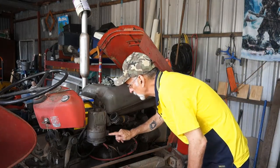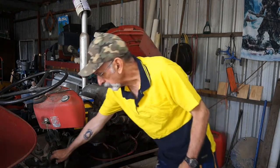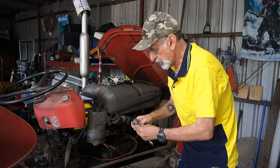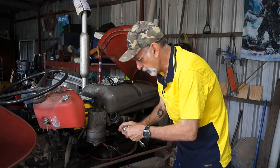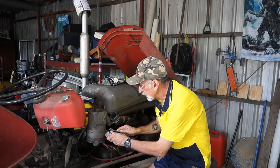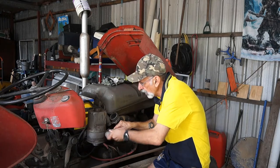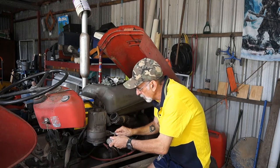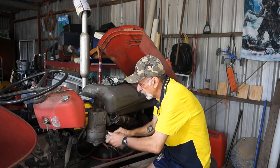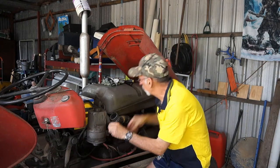So you've got two bolts here, 13mm seems to fit, however I'm aware that all of these are imperial. I just can't be bothered finding my imperial sets, but this doesn't look too tight anyway, so this should do the trick. So lucky I'm looking at this because these are pretty loose over time, so it's telling me to tighten them up, so to speak.